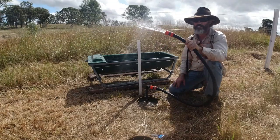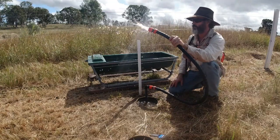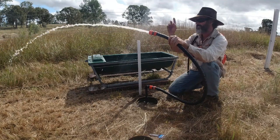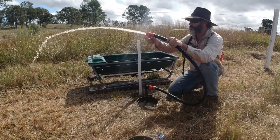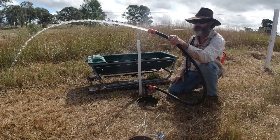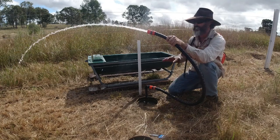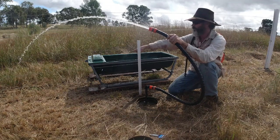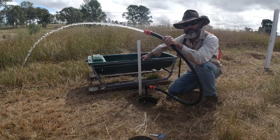You can see I haven't done the commissioning inspection. That's the first air pocket I've had. I've got to go around and do all of them like this, because when they're joining together, there we go, dirty water. That's what I was worried about. I've got to go and do all 37 on the property just to get that dirt out in case there's any loose rocks. I'd hate to get a rock through the flotation device on this trough and then block it up.